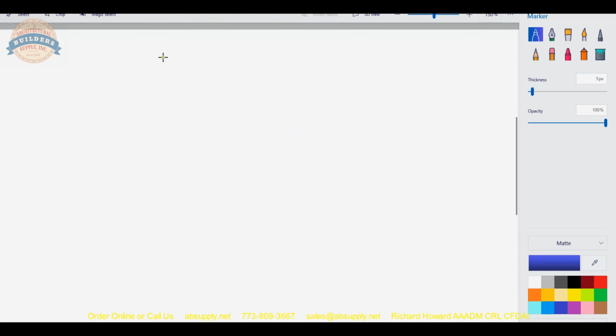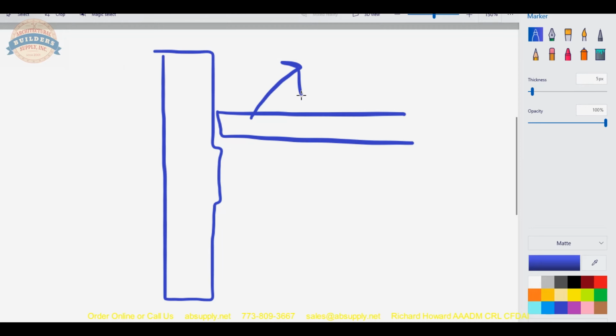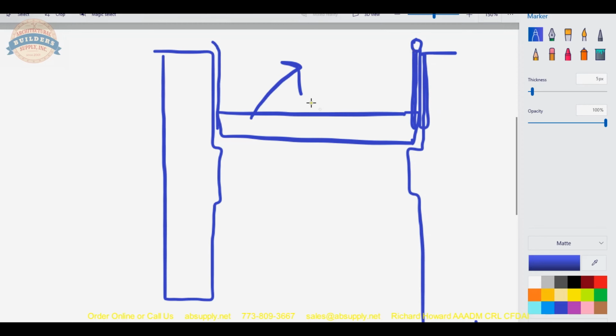I've seen openings that were 18 inch, and the doors were set way in here. 18 inch deep frames because you had pre-19th century construction, a 3-story building where the ground floor walls are extremely thick to hold the weight of the structure above, and those doors are set in almost in the center of the opening. Okay, so you'd need a really long lip for that, and they make them. Well, another thing you might really need, if you were doing a job like that, would be wide throw hinges. You might need a hinge to get you all the way out and around. So extended lip strikes and wide throw hinges do at times go together.